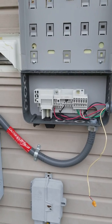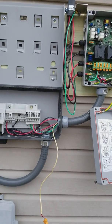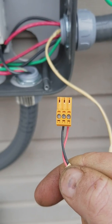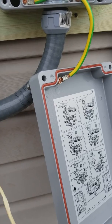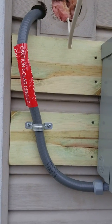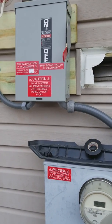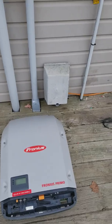Hope this helps anybody, and this will be for me in the future when I do another house. Don't listen to anything I say — figure it out yourself, hire an electrician. Anyway, signal ports — make sure the black is in the center because that's the ground, and the red goes on the N.O., so A = N.O. = red. That just goes inside to the panel which goes down to a 40-amp breaker. The system is about 36 amps so we got 40-amp breakers. Originally I had 60s in there, but the guy said you gotta keep everything close to the rated amps — it's right on the bottom of the inverter how many amps come out.